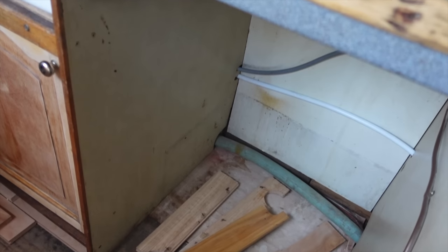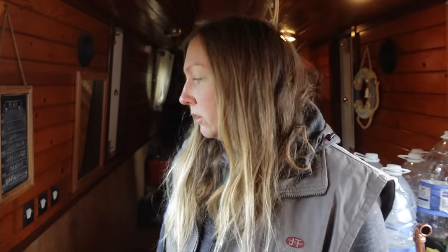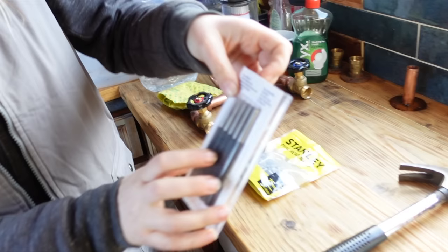I have reached a point with the floor where we have these two little indents here — one under there and a cupboard — and I'm a little bit worried about cutting all the flooring for those bits and basically running out for the rest of the hallway. Some of this floor was a bit rotten so I don't know exactly how much extra we'll have. I've arrived at the conclusion that I'm going to start nailing this properly down to the floor, then roughly lay out the hallway and see how much wood I've got and if there's going to be enough left over. So I have the array of flooring tools: adhesive, adhesive gun, hammer, nail, and my nail punch set.